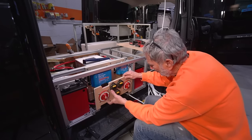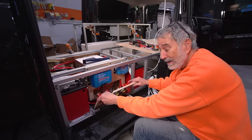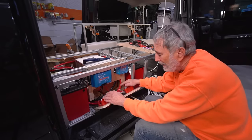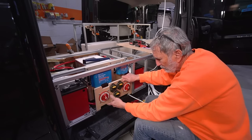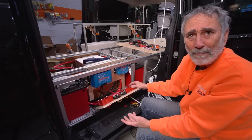And what I'm doing as I work is I need to make sure that as I make my wire runs, that you see what I just did and how easy that was? To drop this panel, if I had to replace or repair any of these, if this switch failed or the breaker failed, it's that easy. You're gonna take a couple of screws out and this thing will tip down and you've got full access in there. Can you see that?